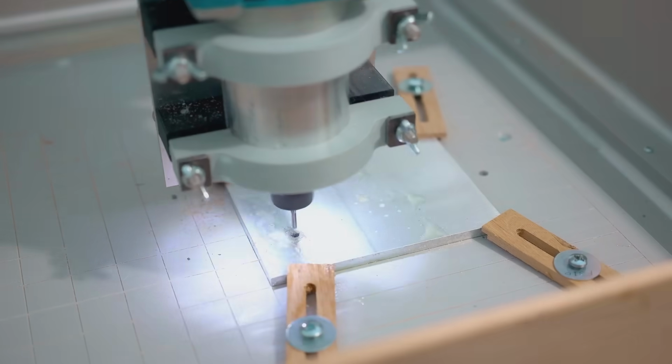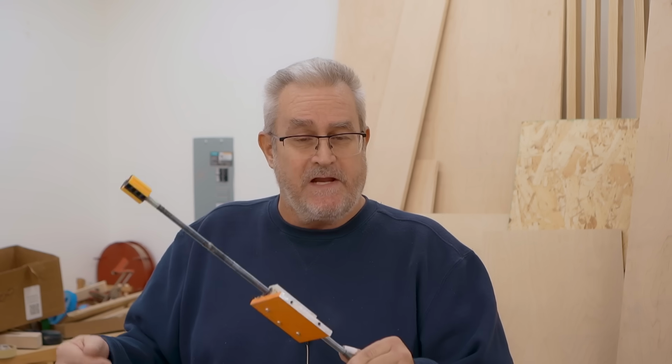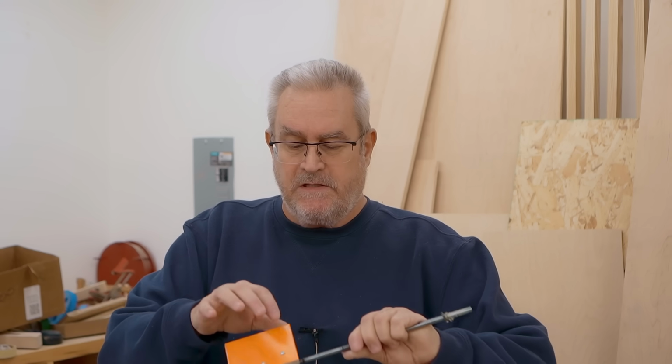When I started working on the design, one of the deficits, or one of the issues with the one this replaces, the one I built last year, okay, and used many times, was the height of the gantry sides. Now, in that instance, they were made from aluminum, from the Stepcraft machine. They're the actual gantry sides from the Stepcraft machine. So it's aluminum that's almost a 1/2 inch thick, okay? And even that had a little bit of deflection side to side. All right, and it had nothing to do